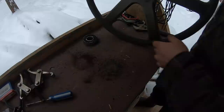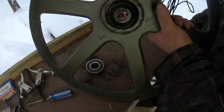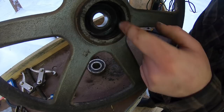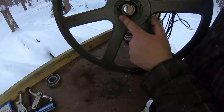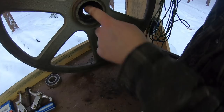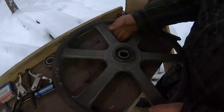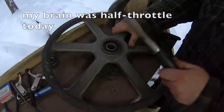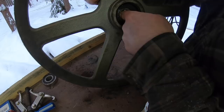Okay, that one's loose. There's a whole bunch of rust in there. I'm using this old nail — keep in mind this is a failed bearing. That was in there solid. The bearings tend to come out the front — they have to, because on the back there's a lip. Don't try to hammer it backwards or you'll screw this up. We'll flip it over and push the second one through the same way. And obviously if you don't have hammer control you probably shouldn't do this, as you'll bung up the sides.